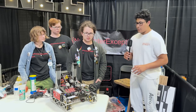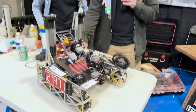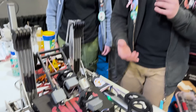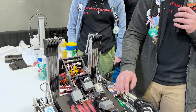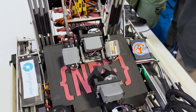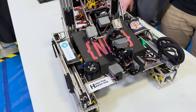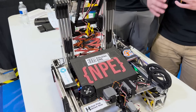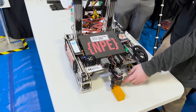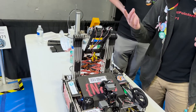Let's talk about your intake claw — what prototypes did you go through and how did you end up on this solution? Our original intake claw had a single finger; we tried to go into the middle of the sample and pinch the edge, but that was hard to transfer and inconsistent. So we switched to a standard herringbone claw design for both claws. We also optimized the geometry — we pivot the intake down so that if it grabs toward the edge it pushes the sample over, preventing it from sitting too far to one side, which was causing transfer failures.